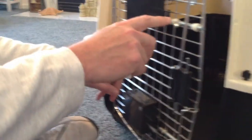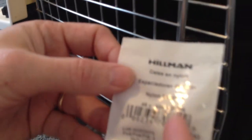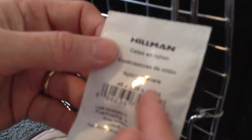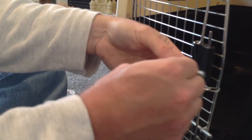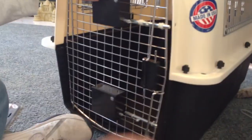Another, sometimes better way — up here you'll notice I've got a more advanced way where we've got these little plastic bushings. You can buy these at Lowe's or Home Depot easily. This is what it looks like — it's a nylon spacer, size 0.45 by 0.325 by 27/64. The length is not that important, but the diameter obviously is. The point is that when you buy these spacers, they're absolutely perfect bushings for these rods that come in those standard barrel bolts. They slide nice and smoothly, so you can use them wherever you want and then just tie wrap them to the rod. It's a perfect, wonderful latch. Easy to make — this thing costs 92 cents, wire is almost free, so it doesn't really cost anything to do this.